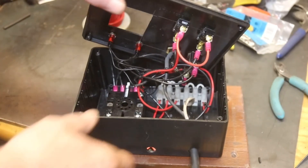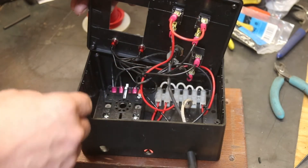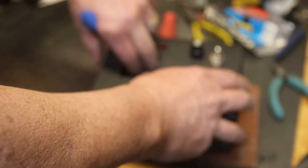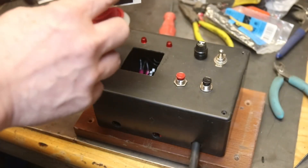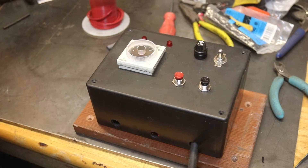Here's the box — it's pretty well wired up. You can see the power coming in here, with all wires connected down to the socket. It's just a matter of getting all the right wires to the right pins on the socket. This has a snap-in base, and the relay has an alignment pin so you've got to get it in the right place. So it's ready to go — we'll give it a test.